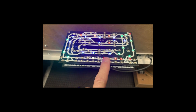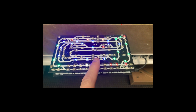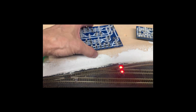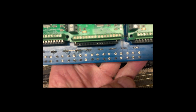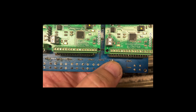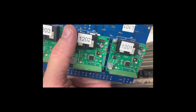The other thing I wanted to point out is if you're using boards with surface mount technology, you can set up the board where all the wiring is already done. You end up with a thin board like this, and you just solder in the two decoders — that's it. Whereas with this kind of board, I had to solder in the LEDs, and there's a lot of work — the solder joints are tiny, there are four wires for every LED, and if you cross them or use too much solder, you've got problems.